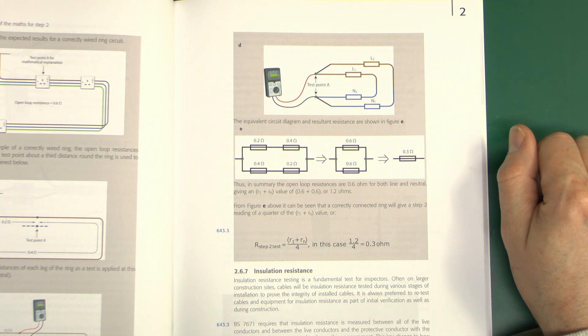So an explanation of how the two values of two loops of wire, divided by 4, equals the resistance measured between the two conductors when they're installed normally. It is just that idea of a circle — measuring across and dividing by 2 for the half of each, and then dividing by 2 again because there are two of them. And if not immediately obvious, go and watch it again. Or of course, the easy way to avoid all that bother is to not install ring final circuits at all — just install radials, like the rest of the world has been doing forever. Thanks for watching.